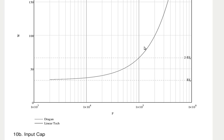New ferrites are being developed. New being what? Like still ferrite, iron oxide, but with some additives or different processing? Different processing and different materials. But you have to think on a time scale of years, or tens of years, decades, I guess, would be better. In the last decade, there have been a couple of new ferrites. The 3C94 material is only about 10 years old. What kind of performance improvement did that provide? About a factor of two, in terms of the losses of the transformer, at the same frequency.